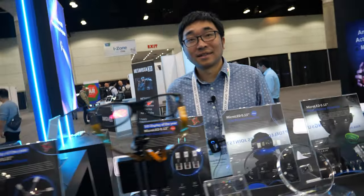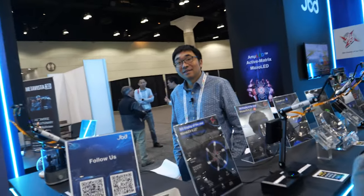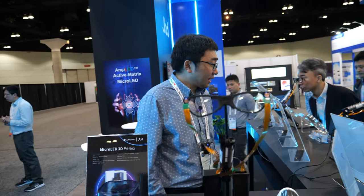The previous videos I did with JBD, you were talking about million nits. How do you achieve so much brightness? At the individual single color monochrome panel level, we now have 0.75 million nits from red, 5 million nits from green, and 1 million nits from blue. When you combine all three colors together, you can achieve such high brightness.